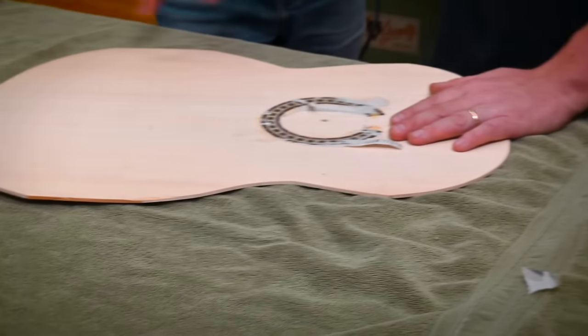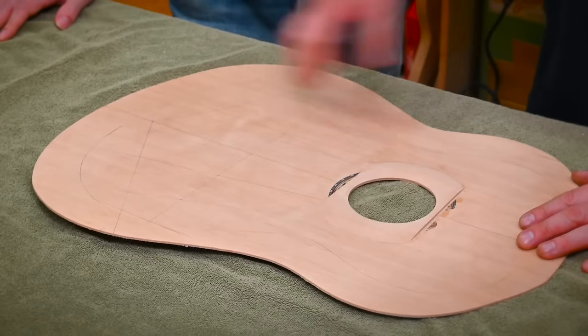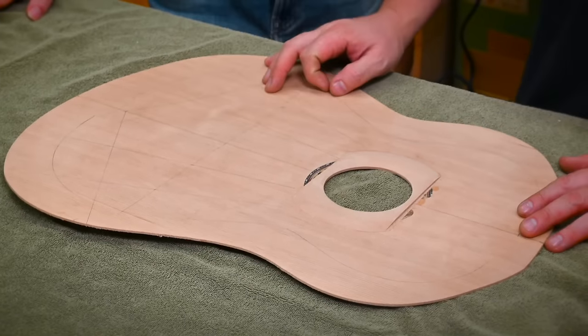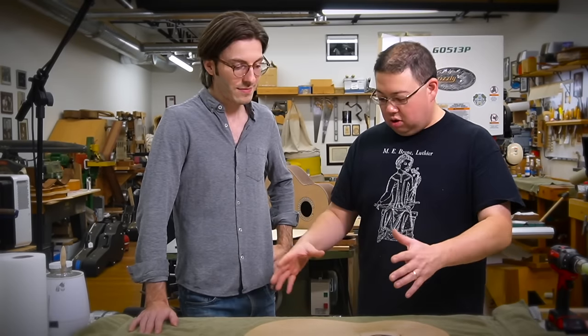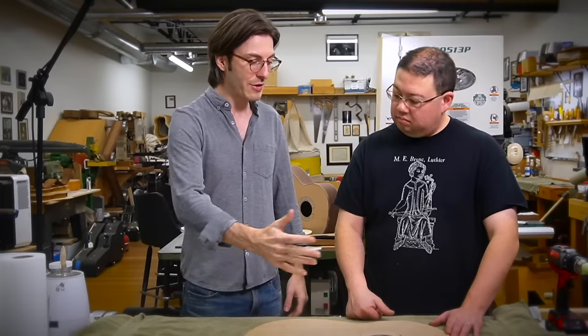This is a custom outline — this is the finished part. So basically this is a rough oversize; I'm going to put the braces on. This is the guitar I'm building on my channel — this is the outline — and this one has the rough shape of the braces sketched onto it. I decided what the sound should be, and then using my knowledge of all these historical guitars, kind of did a rough sketch out. So once I get ready to glue this down, these braces are going to get glued down and then this is going to be glued to the top. So we're getting really close now — we've made it from wood selection, listening to the resonance, down to chopping it down, getting it very thin, two pieces together to make a soundboard. Now you're going to do some internal bracing.